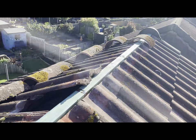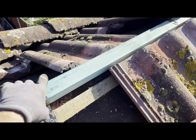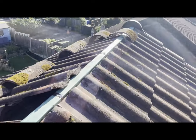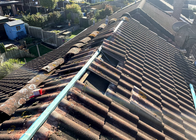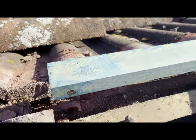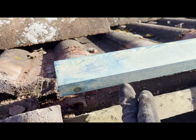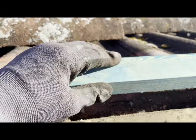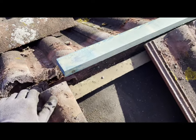There's probably going to be people commenting and saying it needs to be under the batten - yes, you can remove the batten, take the nails out, and fit it underneath, but in retrofitting there's not a massive amount of value in that. It's just going to take you an extra couple of hours basically, and this is solid and not going anywhere. As I'm getting towards the end of this first length of batten, there's a nail there indicating where the rafter is, so I'll cut the batten here so the join is on a rafter rather than floating between rafters - that way it's a bit more solid.